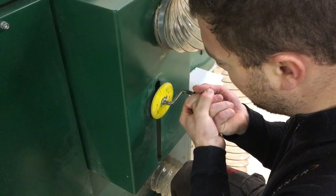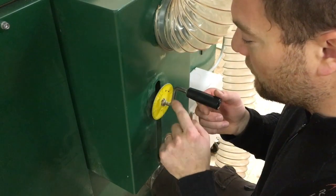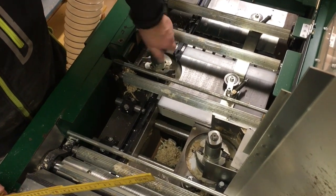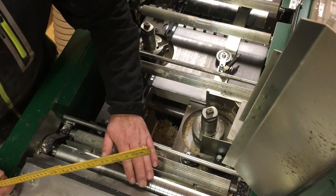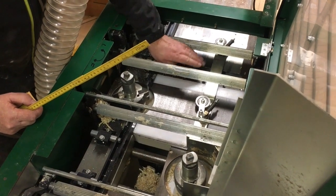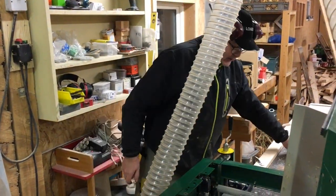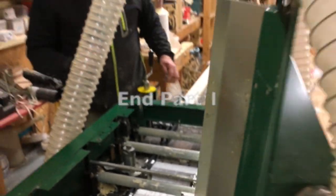You have to adjust the width here. My dad needed one millimeter — one full turn is four millimeters, so he did a quarter turn and now it's exact. Now we have to check if all the cutters are spinning freely and not going against anything. The bottom one — or actually the top one — nothing is hitting any metal, which would be very bad. They're spinning freely. He's not fully happy with it yet, so he'll explain it.